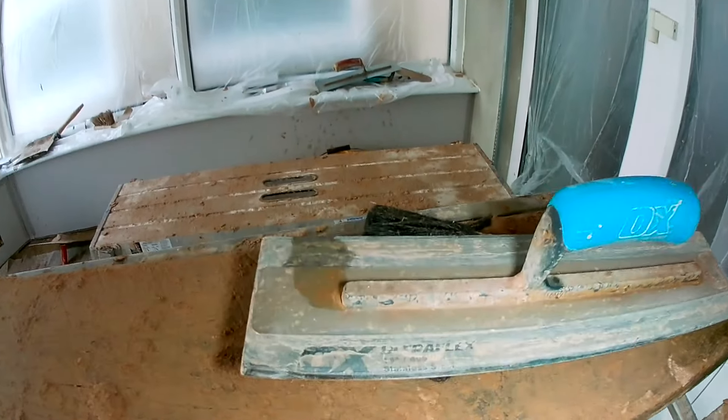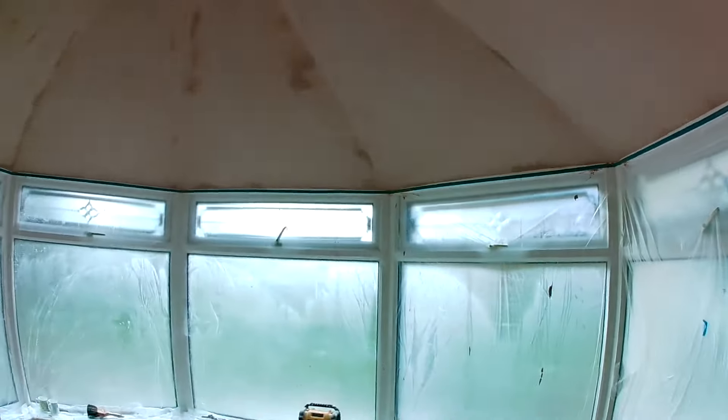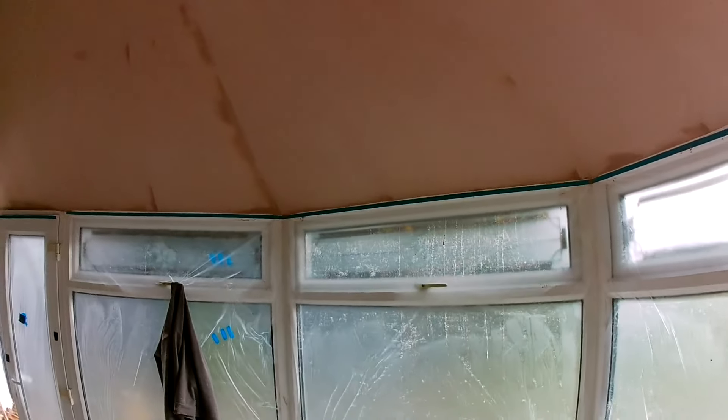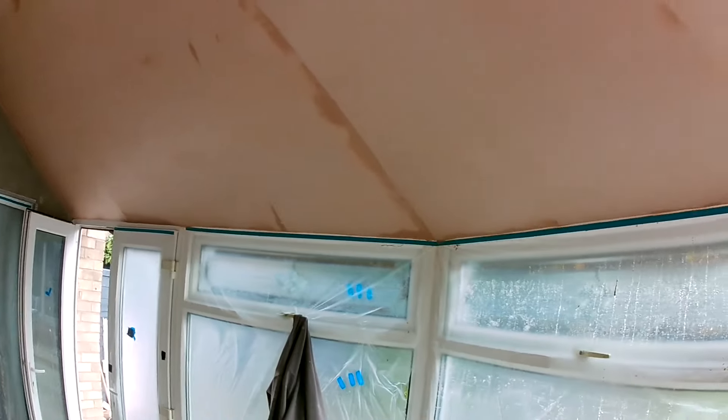Right, so we've had two trowels now and it's just about to have the Ox Ultra Flex - sorry, Ultra Flex - and that's what we're going to hit it with now with a bit of water. The Ultra Flex is better than the Super Flex. Past the ceiling, all finished and skimmed - it's lovely. I was losing control of it but I managed to bring it back. It just started to rip so I had to lash loads of water on, but look at the shine - the sheen over there, it's all real.